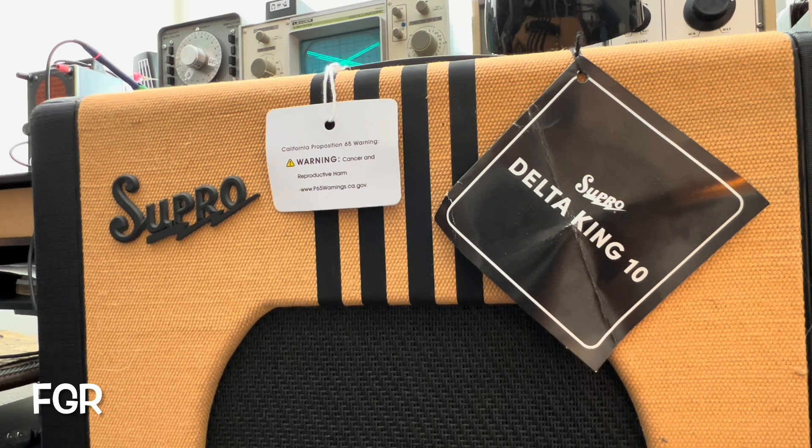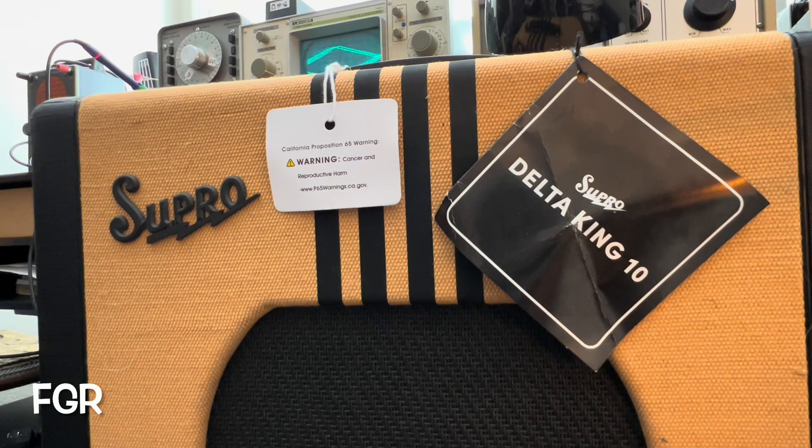You guys be safe out there. This amp was incredibly challenging to work on because the bias resistor is at the bottom of the PCB and you cannot test anything until the amp is fully reassembled. Getting the main PCB out proved to be quite challenging. They had various obstacles including very liberal use of — it wasn't the usual RTV, it was something like caulk almost. I had to use my wire cutters to get through it, then heat it up and scrape it. They had literally caulked over several key solder joints that I needed to access to do the repairs. Shame on you Supro, but she's sounding nice now — for how long, who knows. Hopefully long. Bye.